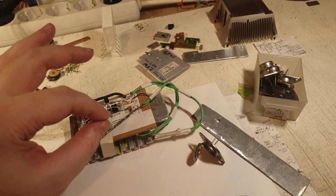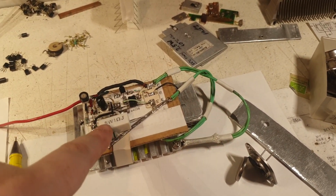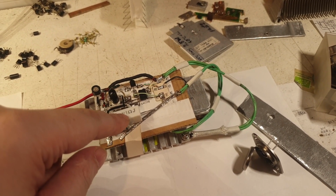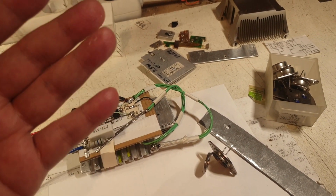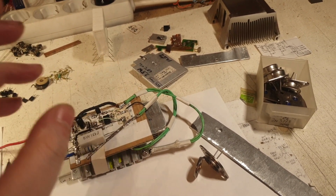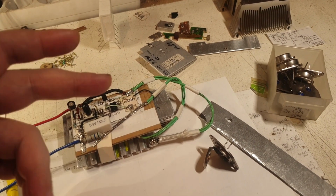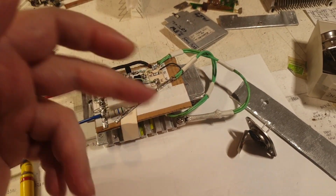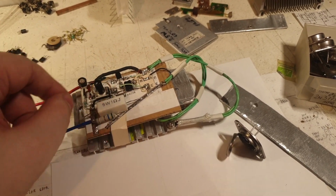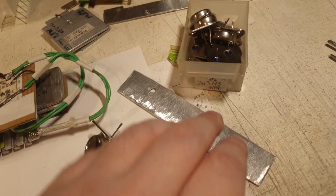And for a very short amount of time, I can add another lower than 1 ohm resistor, like 500 milliohms, so 0.5 ohms, and test it at even higher wattage if I really need it. But that's the beauty of this contraption that I have here, that is extremely hackable. I can take this out and put whatever I need and then put this back when I'm finished with that, and that was the project.